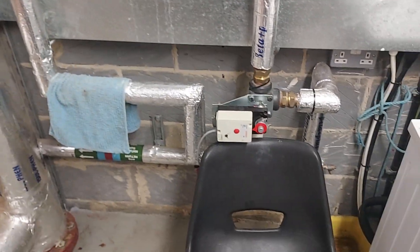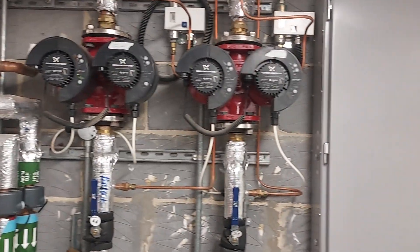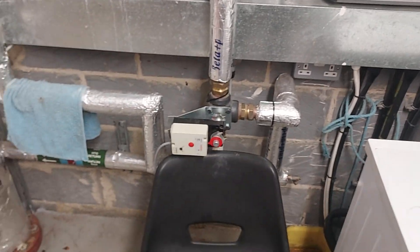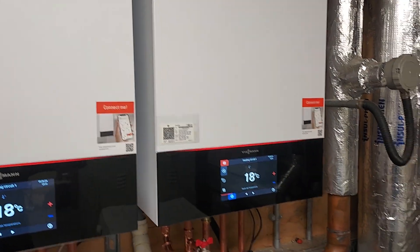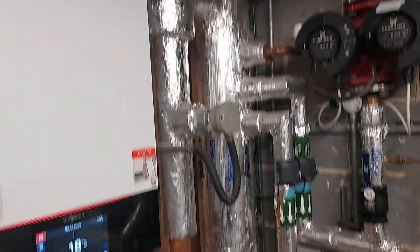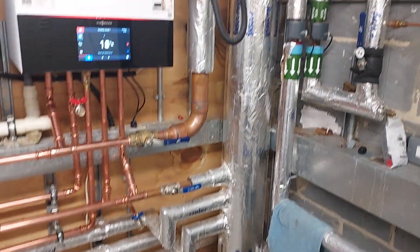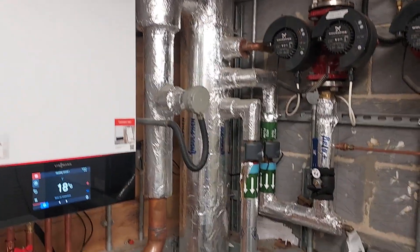So that's going to come out, and we might be leaving this one attached to the low loss header rather than as we originally intended. The next phase of the work will be to directly connect the radiator circuit to the left boiler, and we'll leave the right-hand boiler connected to the low loss header to run the underfloor heating circuit. Originally I planned to replace the low loss header, but I decided it will work fine — if it's only doing one circuit it will be perfectly okay. It's only the way it was configured for three circuits that was a problem.